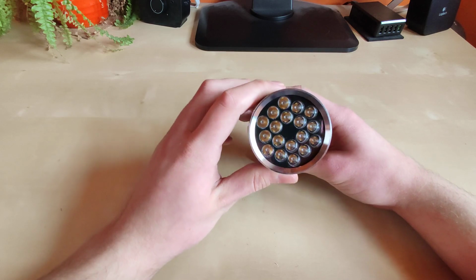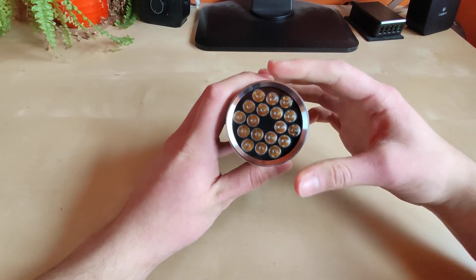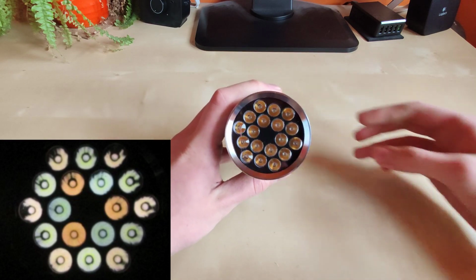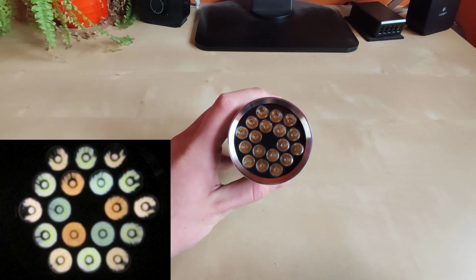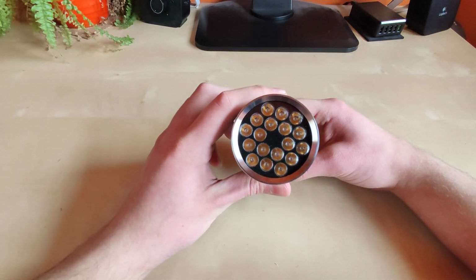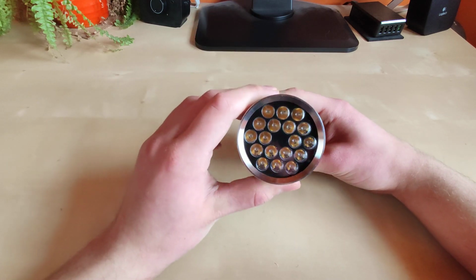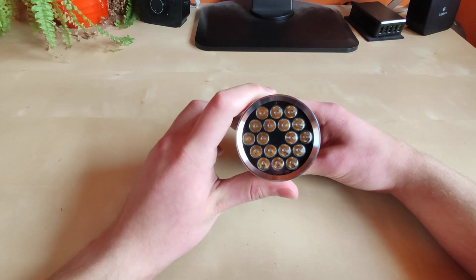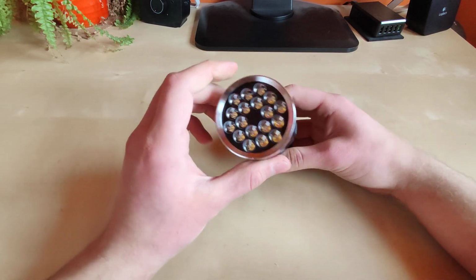And if you wonder if this flashlight is available in different LEDs, here you got them on the screen. You can also email Hank to change the patterns of LEDs. So for example, order 4 LEDs in 3000K, then 4 LEDs in 4000K and so on and so on. So mix the tint in your flashlight with different LEDs, and you can probably also ask to install the XPL HI LEDs, although I heard that in this particular optic style the XPL HI are not the best choice because the beam is simply not focused enough, so that's why Hank offers it only in SST20 version.